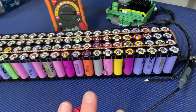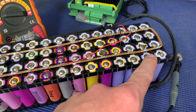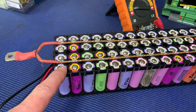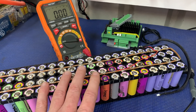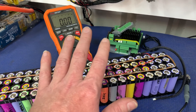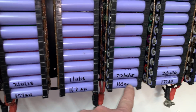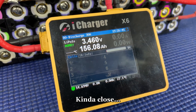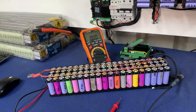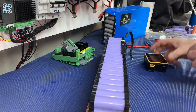They're all about 3.88 volts, so no disconnected fuses on the battery itself. There are two ways forward: I could disconnect all the fuses since they're quite simple to put back on, or I might charge it all the way back up to 4.2 volts using the iMax X6 charger and then do a discharge test. I've got rough capacity figures — 157, 162, 165, 177 — so I know the rough size it should be. I'm thinking it'll come in around the 130 to 140 mark. Let's set that up and get it started.